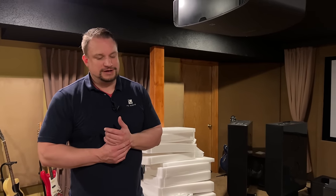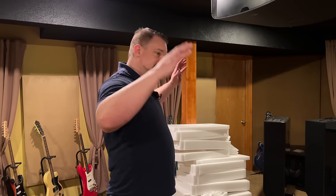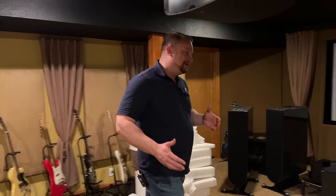I had done some work in the home theater custom integration world, so how audio interacts with the room is pretty important. It's all currently absorption here rather than diffusion. One of the important things for the sense of spaciousness — and also the power requirements go up a little bit as you damp the reverberant field of the room — is that you typically want a balance of diffusion and absorption. Especially the sidewall lateral reflections, which are important for the sense of width and spaciousness in two-channel.